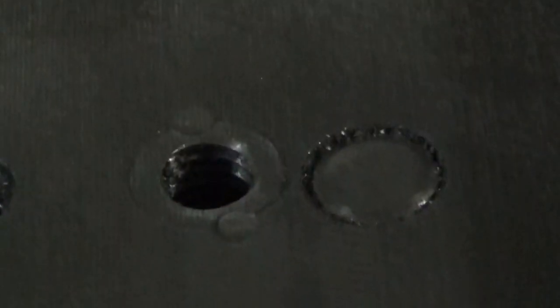So that's all faced off, and I guess the thing to do will be to give it a little bit of a stone up, put the jaws back on. I think what we're going to find is when we put this jaw back on, that this one's a fraction lower than this one. So what I'm going to do probably is face this entire surface here nicely too, just to bring it up to spec, and put it together, and that's going to look pretty good.